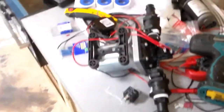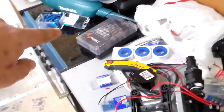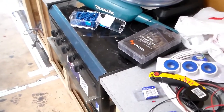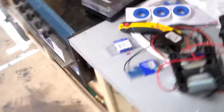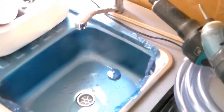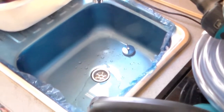My only slight concern is that it's going to be pumping from here and across under the floor, and there's a T-section where it joins the drainage from the washing machine and the sink, and then continues to the tank. I'm concerned that if I'm pushing water this way, there's a chance it could come back up the pipe to the sink drainage and give me a water fountain spurting up. I don't think it will — I might have to put a one-way valve in there if that turns out to be the case, but I'm quite confident it will solve this drainage issue.